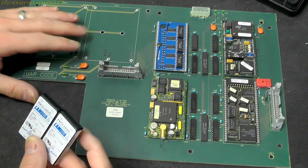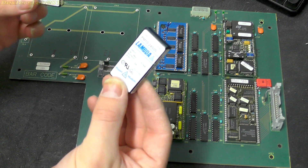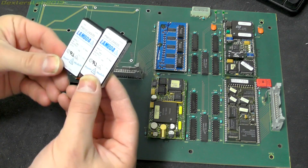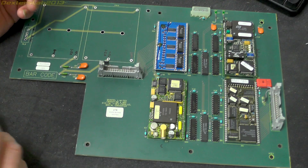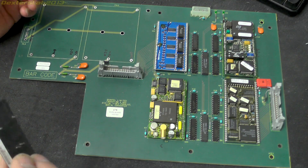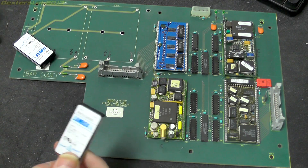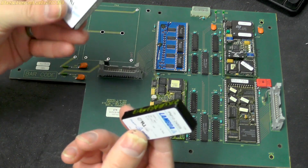To replace the old power supplies I was going to use these two Lambda DC-to-DC converters — 5 volts each, wired as plus and minus 5 volts. However, these have a current limit of 2 amps. Unfortunately that's not quite enough: I've already powered this up on my bench power supplies and the positive 5 volts draws about 1.5 amps, and the minus 5 volts draws about 1.2 amps. On top of that, the fan draws another 300 milliamps, putting us right on the 2 amp limit, so I've decided not to use these.